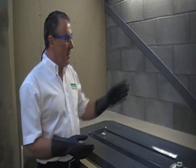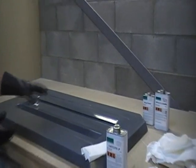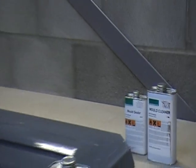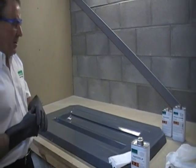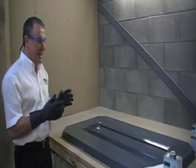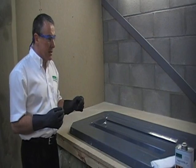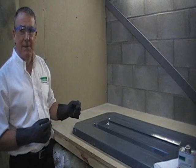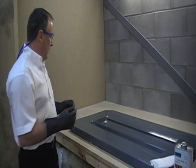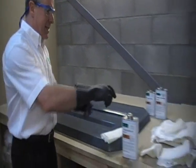So far we've used the Marble Coat mould cleaner to clean off the mould — whether that's new or used it doesn't matter, we've got to get it to a really clean state. For a new mould we've talked about putting the mould sealer on, and we've applied two coats leaving a minimum of 20 minutes after each coat — ideally overnight, because that hardens off the coat that little bit more. We now have the mould exactly as we want it and we're now going to put the release agent on.